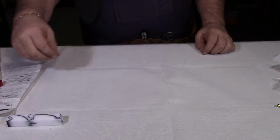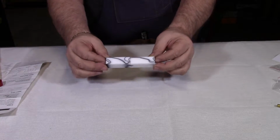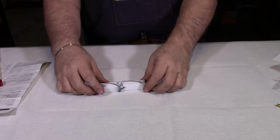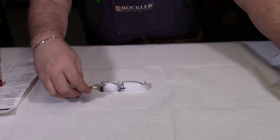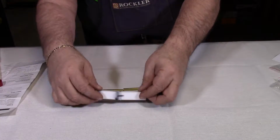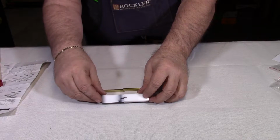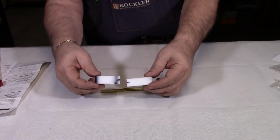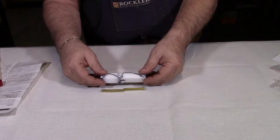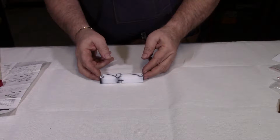What you need to do is to pick out a piece of material that you're going to use to put this together with. I picked out a piece of acrylic here. It's a white with a black thread swirl through it, and I measured these and cut them to be the same lengths as the tubes. I've cut them on the bandsaw already to length, and what I do is I want to match up any patterns or wood grains, so I'll make this kind of mark here as a reference for when I put it on the lathe, that I match these bodies up, and I try to keep these matching together all the time, so then when things are assembled finally in the end, it'll all look like it falls together and the patterns go together. So pick out a body of your choice.